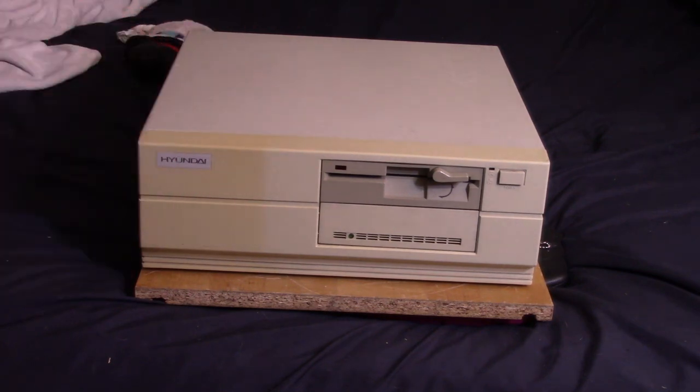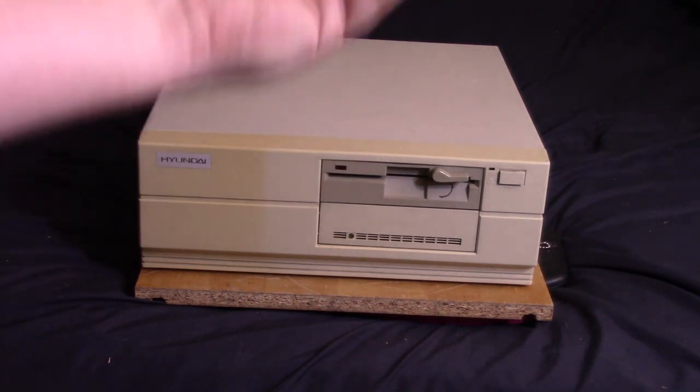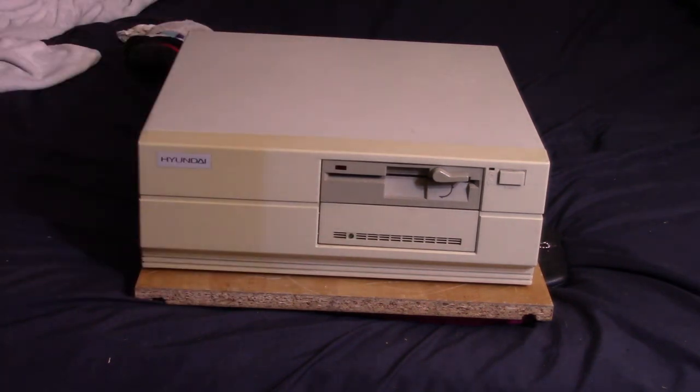It's a very basic front. You only have six as opposed to eight ISA slots, not much built-in at all — one serial, one parallel port, and a floppy controller, so one of those ISA slots is taken up by the hard drive controller card. There are just better options if you really have a craving to game on an 8088 or want an 8088 machine. But it does work as advertised. If you have one or a chance to pick one up cheap and you want an 8088, sure, grab it — just know there are better options.